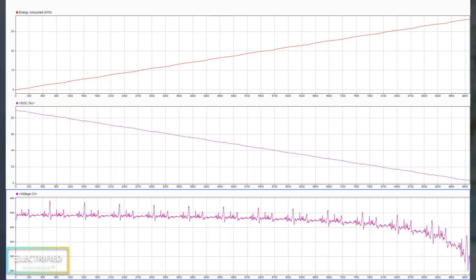The output is a drop in state of charge as you run through the different drive profiles. We can simulate whether we can make it all the way to Chicago O'Hare and back, or whether we need to stop and charge somewhere. This MATLAB model will be available for you pretty soon, so you can apply your own drive cycles wherever you live, including outside temperatures. You can change battery sizes, change the electric motor, and see how it would work for your specific application. When the Jeep is finished, we'll gather real data to see how well our models predicted the actual range.